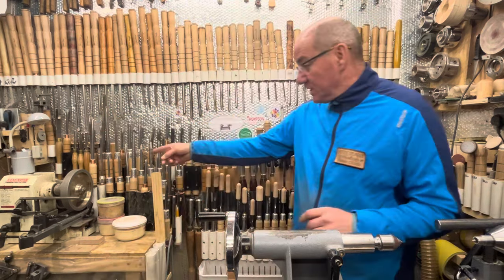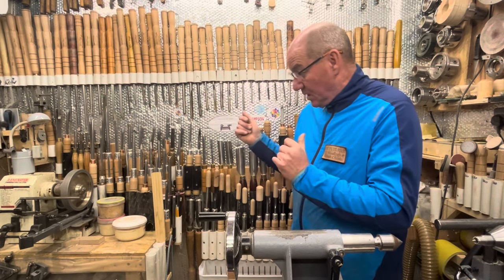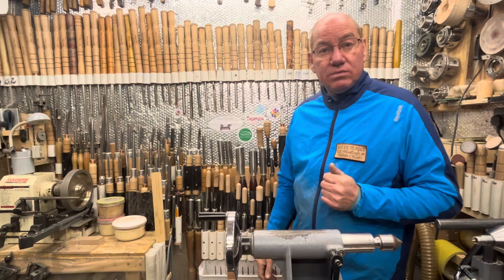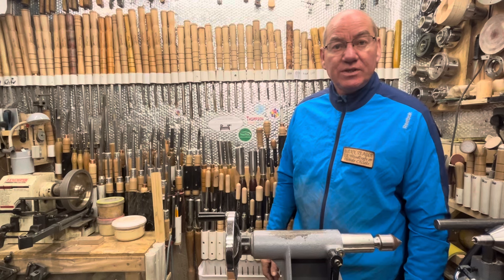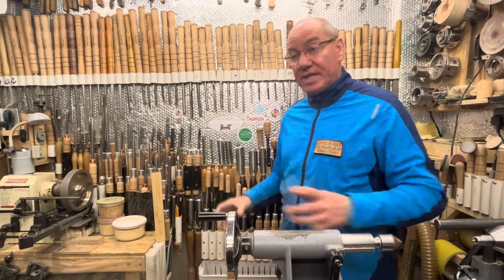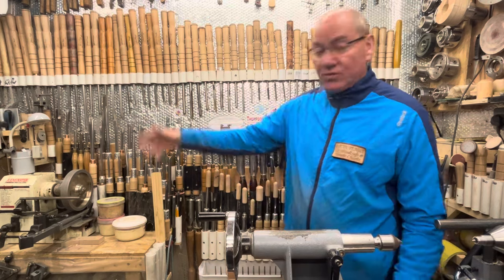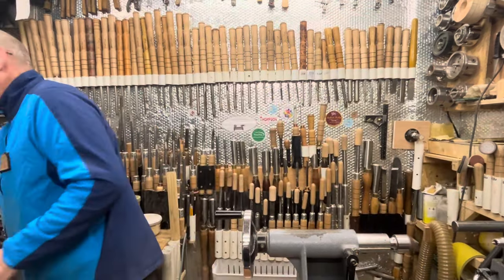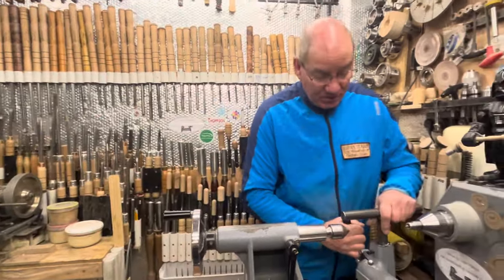If you've got the wheels, these big wheels, normally they come with bushings or whatever. Just get a grinder, a cheap one from the boot fair. Pick them up for five or so. It doesn't matter if it works, you're not interested. You just get it home, strip it down, take the arbor out, put the arbor in, bolt your wheel on it, go straight into a chuck, done. Job done.